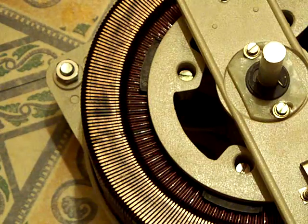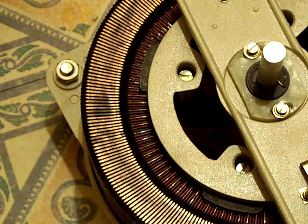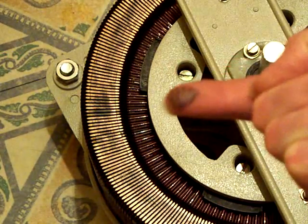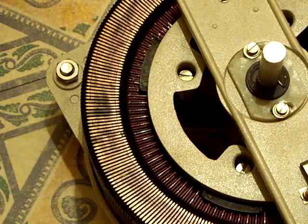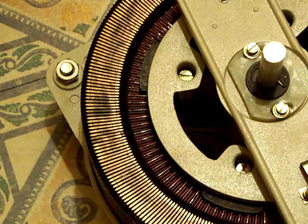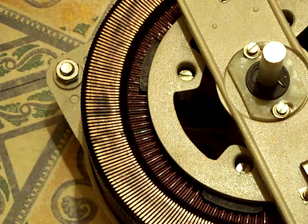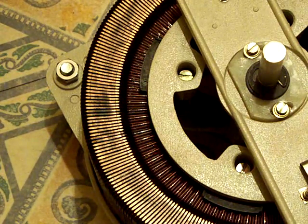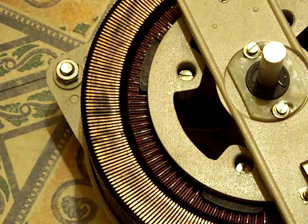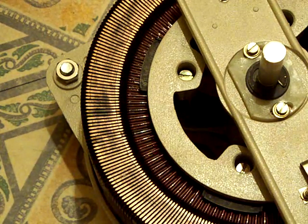I don't know what's going on there. Watch this — there's my finger. See that? I think that needs a bit of a clean up. I'm going to lower that camera down and give it a wiping off. What I should probably do off camera is get a toothbrush and get in between each of the windings to make sure there's no brush build-up in there. Because something was sparking and popping in there a couple of nights back. I'm not impressed. I've pulled about 3.8 kilowatts out of a little 10 amp puppy and it deals with it — that thing can't even take a 2 kilowatt fan heater.